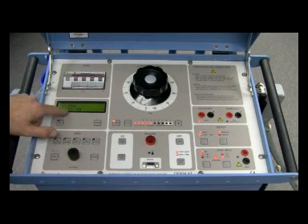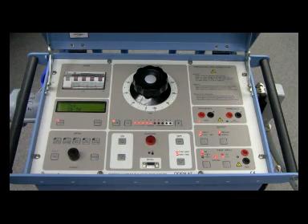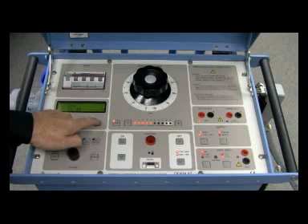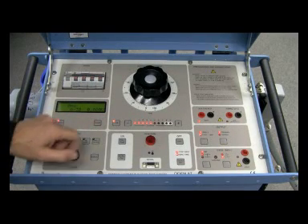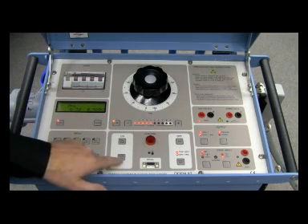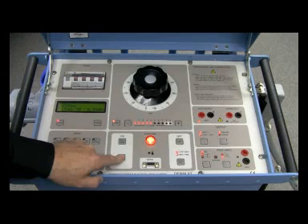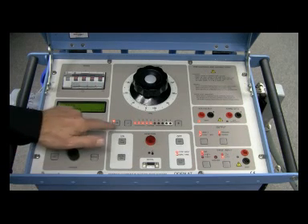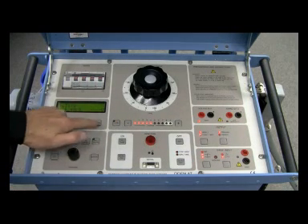I see I've only got 38 amps out there, so let me check the output breaker to make sure it's reset. After resetting the breaker to a closed position and resetting the ODIN, still on I-over-30, I do a momentary injection — it looks like I'm going to have around 1,500 amps once I take off the I-over-30 function. That should be enough to actually trip the breaker.